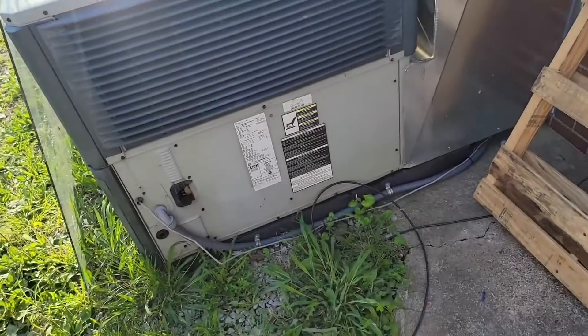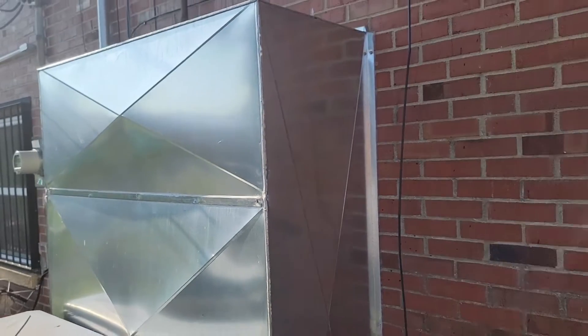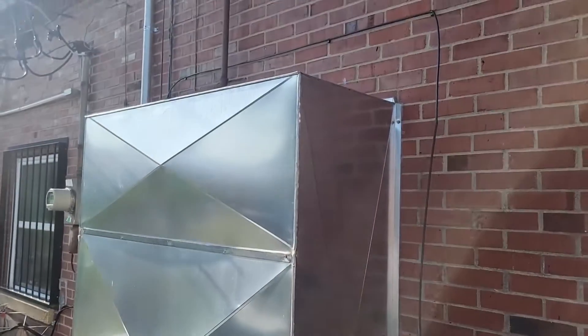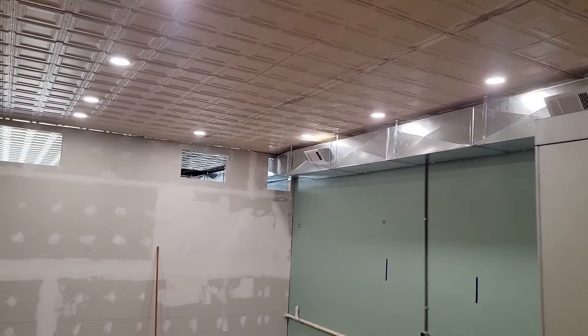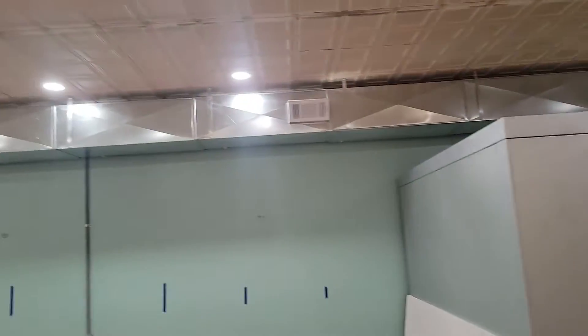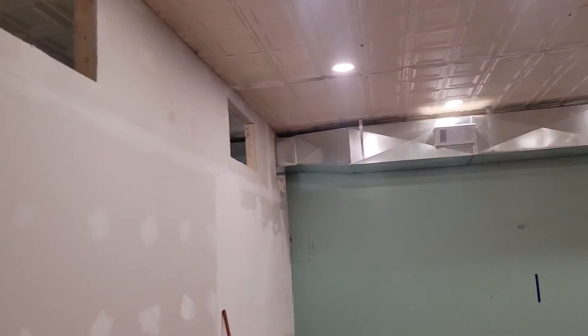This large rain shield is going to go away. We're just going to run square duct outside and make sure it's sealed properly. The guys spent one day in the shop building duct and one day on the job. Look at this — got all the trunk laid out across the whole building. Got the custom boots in. Looks like it reduces down before it goes through the dividing wall into what's going to be the seating area.